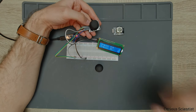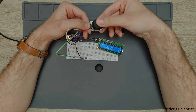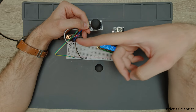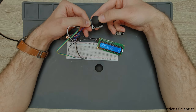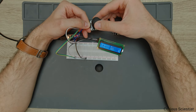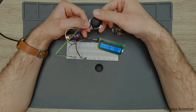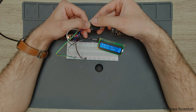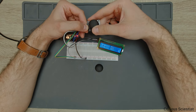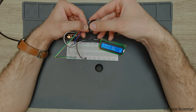Let's move this joystick towards the right side of the screen slowly — this should be the X axis. You can see the numbers increasing: 800, 900, 1000 — done. Now I move it to the left side and it's decreasing, pretty much zero. Let's check the top of the screen — moving up is actually decreasing, and pulling it down is increasing. So the positive direction on the Y axis is inverted regarding the numbers — I'm just directly reading the analog-digital converter of the Arduino. It seems a bit funny but I wanted to show you can make a very easy controlling circuit.